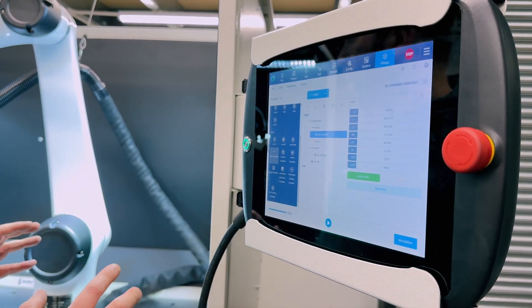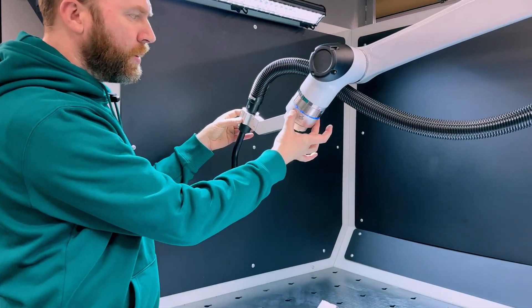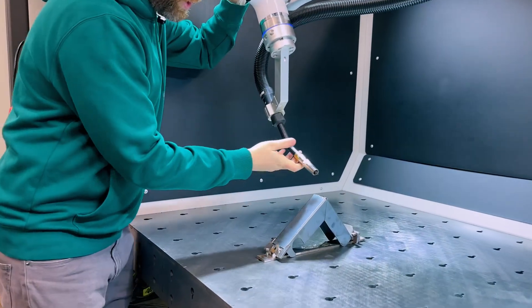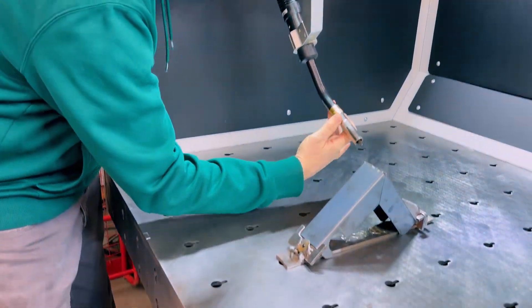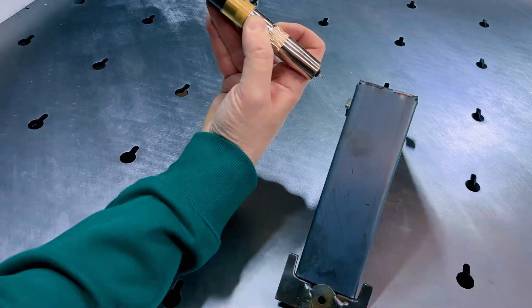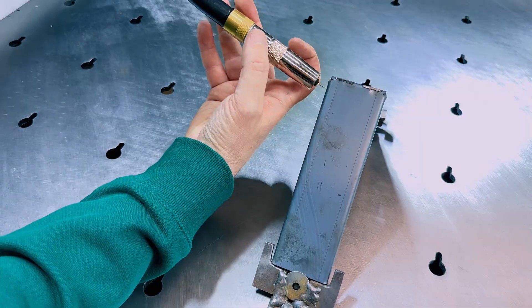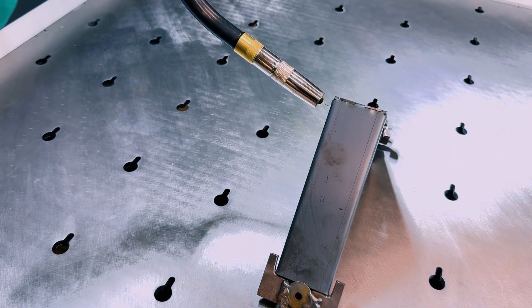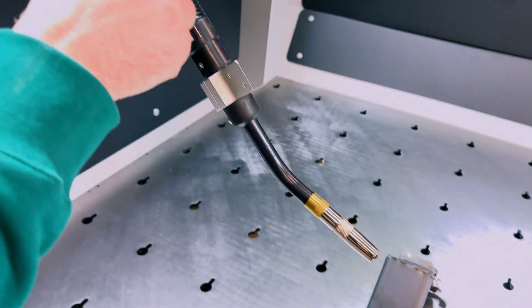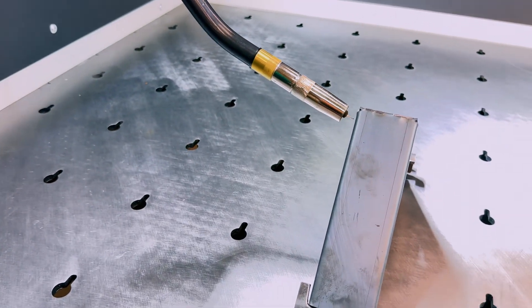All we need to do now is come to the robot and push the free button — this goes blue, and now it's free to move anywhere you wish. We're going to go to the start point of the weld, which is right at the top. This is a manual welding guide. We want to set it up right about there where you would generally start — about 10 millimetres off, maybe slightly less. We lock it in place, then press the point button, which saves that point on the controller.